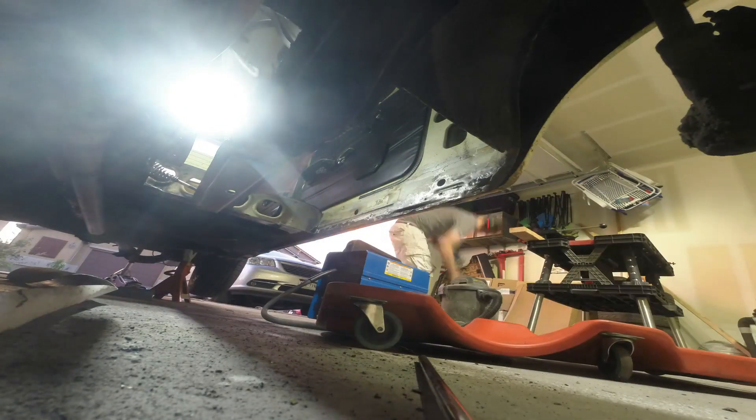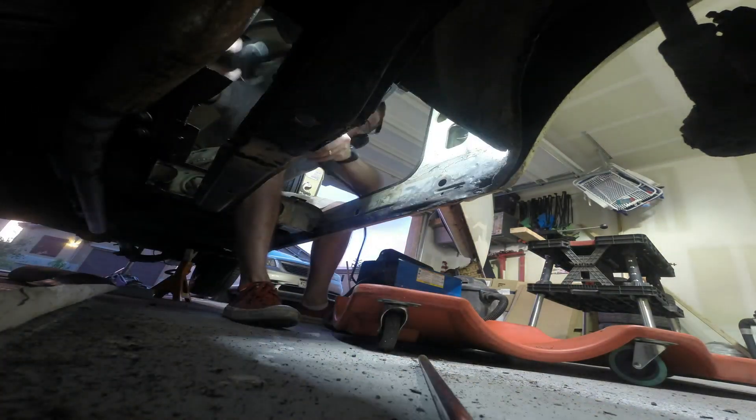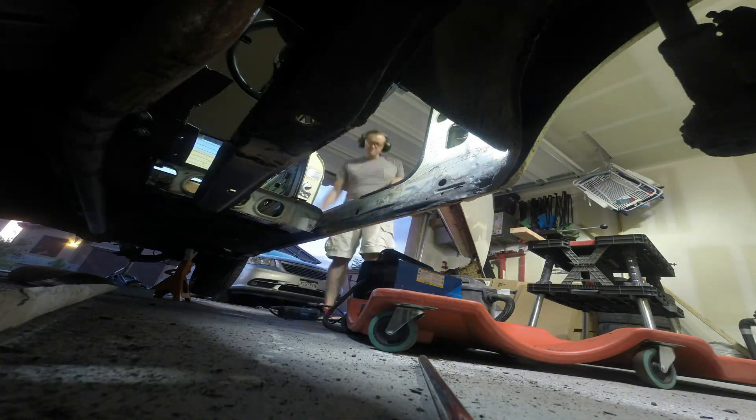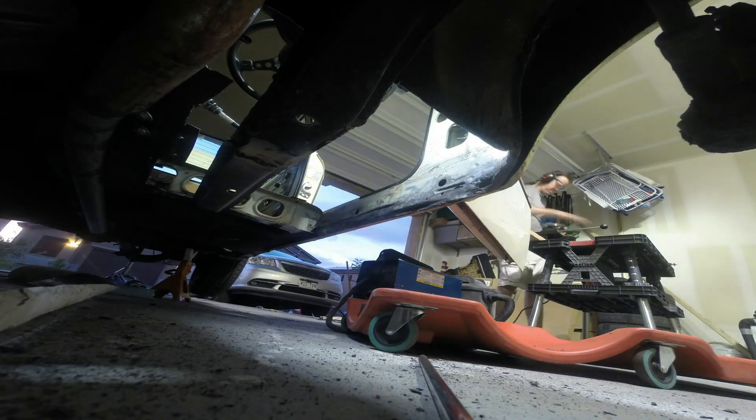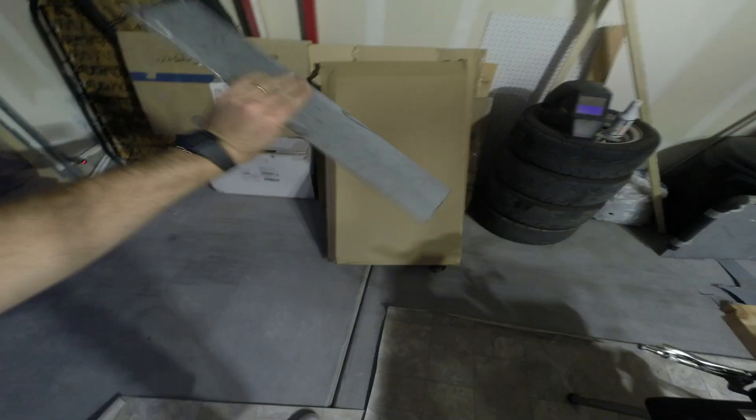Here's where I noticed that the front metal piece where the side meets the firewall was rusted out pretty badly. I ended up deciding to cut it out and make a new piece to go in its place. First I cleaned up all around it, then got out my grinder with a cutoff wheel and cut it out. There's the new piece.